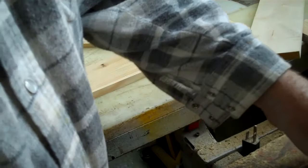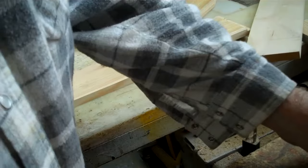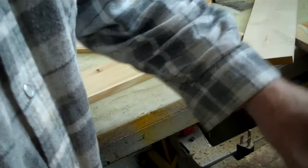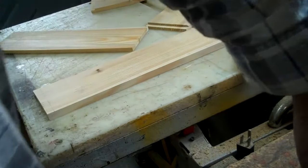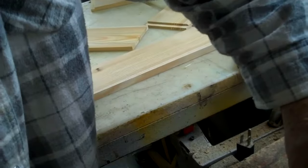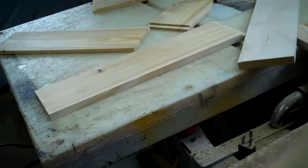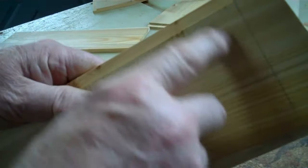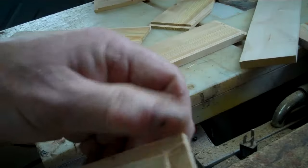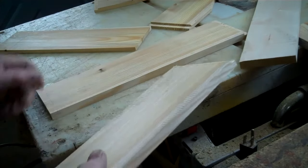This is where the notch got to be. So you just scribe a mark in there with a cut, with a utility knife or whatever, along that line right there, and the jointer won't crack. Take a mark across that way. And you shouldn't split it off, really. So all you're doing is just scribing a little mark. So I just ran that through on the jointer. Made the notch there. And that little scribe mark right there stopped from splitting. So I got two of those to do.